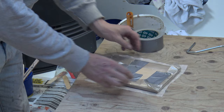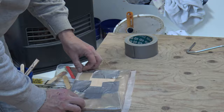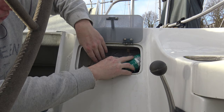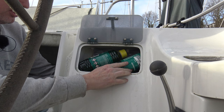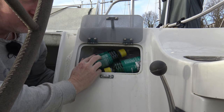The plastic is on, and then I just need the peel-ply on in more or less the same way. I have placed my plywood in here with the peel-ply on, and then I found some old plastic bottles that can keep the plywood in place — just like that. It's okay, it's not perfect, but that's what I've got. I'm ready for laying up fiberglass from the inside, and I'll just remove the camera so you can see it as well.